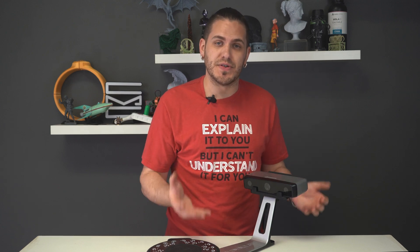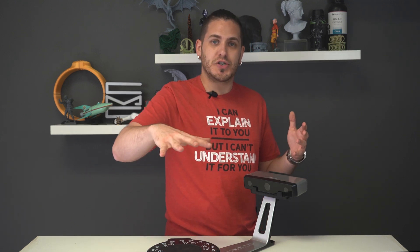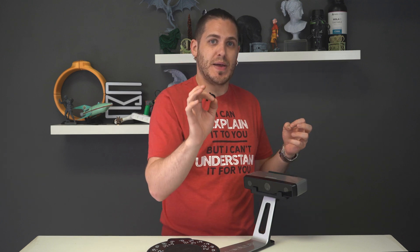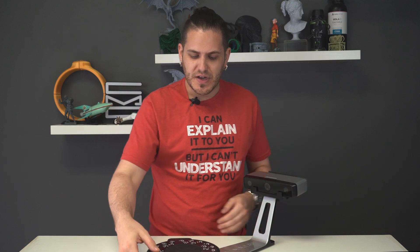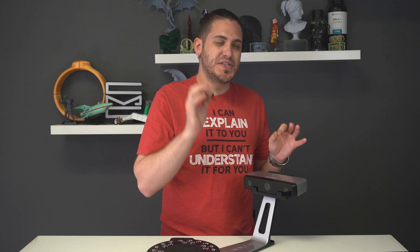Aside from physical factors, there are some things in the software you really do need to consider. You can have the software scan based off of the turntable itself, so that every quarter turn the image it gets is what it is. Or you can have it scan by features, which is the best one. You can also have it scan based off of target markers on the turntable. However, as intelligent as that was, we still found it very difficult with jewelry — basically borderline impossible. We still weren't able to get those accurate stone settings and things that we wanted.